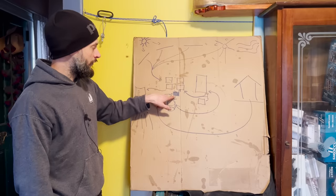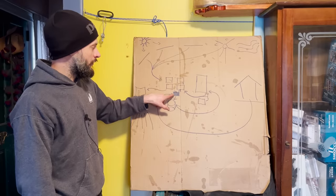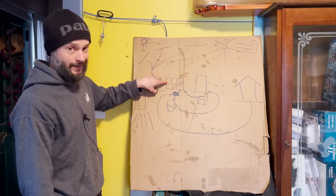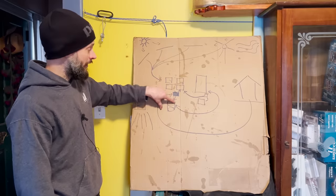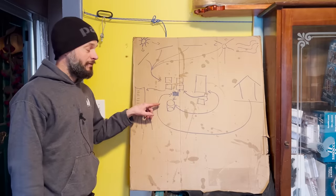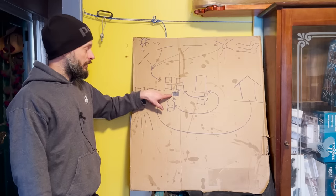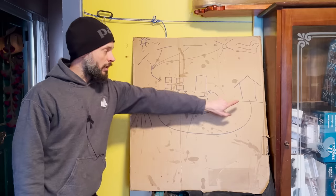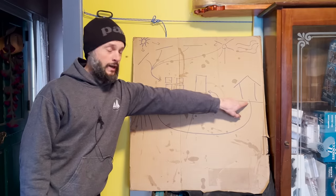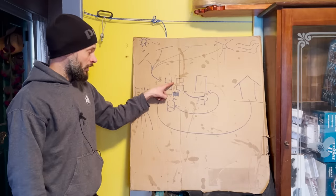Now we're going to put an inverter into the boat, which is what this blacked out square is. And the inverter is a charger and inverter. So we will be able to take power from the batteries in DC, put it into the inverter and have it come out AC, which we need to run the water heater, which I decided to put in. I got convinced. So the 110 water heater will run off the inverter. The other thing the inverter does is it allows us to charge from shore power, such as a house or a dock or generator. So that 110 power would come into the inverter, which would flip it into DC, and it would charge the batteries.